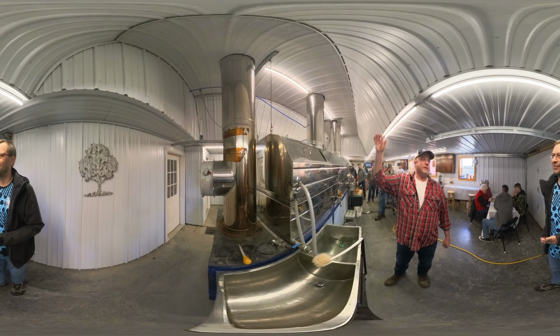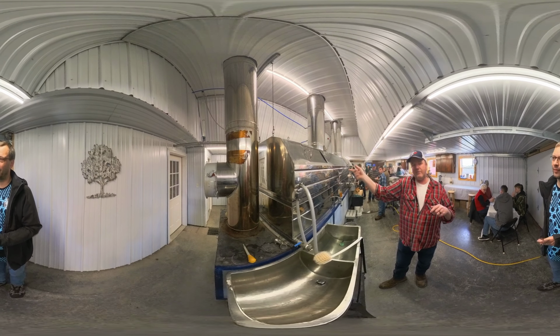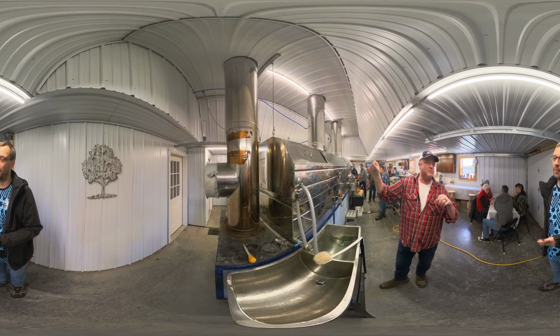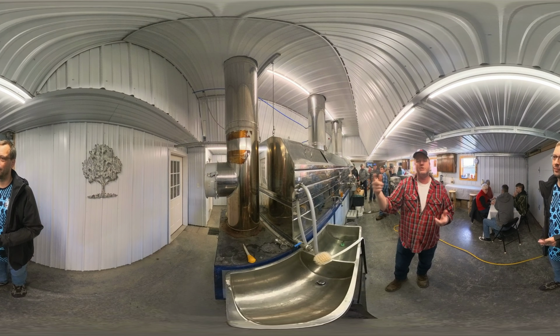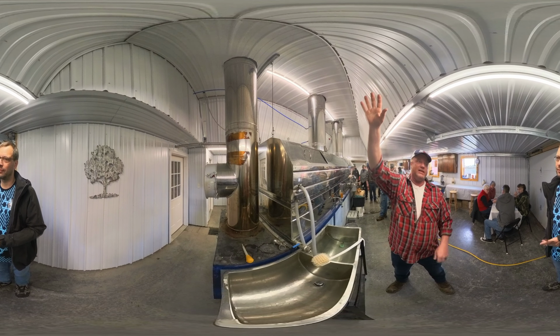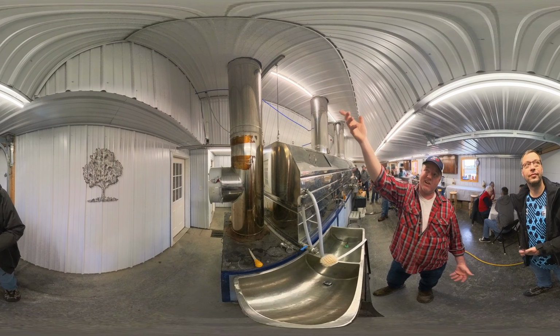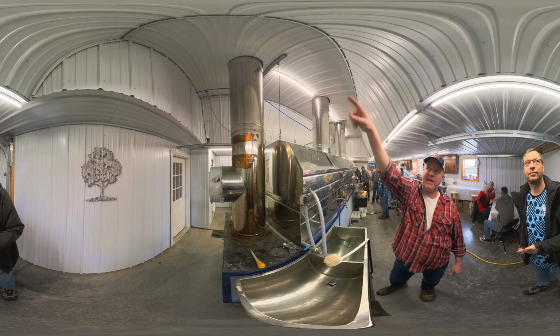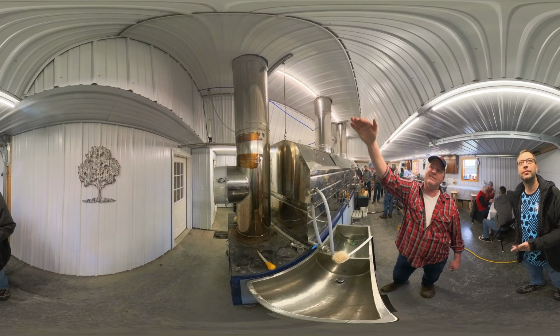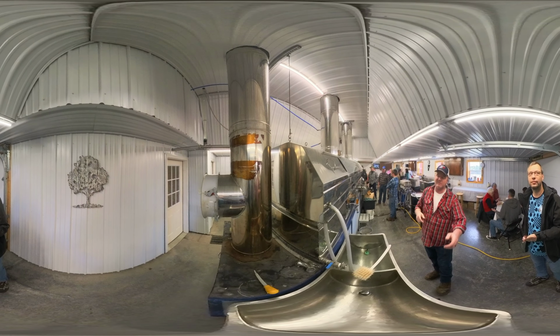I'm Russ. Hopefully Tracy on the other side explained to you that it's coming in at about 1.5 to 2.0% sugar. It runs to the RO, which gets you to about 18%. At that 18%, it gets sent up into the concentrate tank. You can see how much sap or concentrate is in that tank based on this sight glass here. That zip tie is at the bottom of the tank, so we've got about 2.5 feet of concentrate upstairs. That's a 600-gallon tank upstairs.